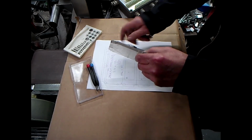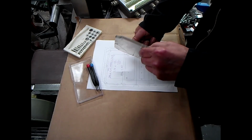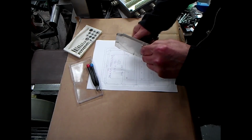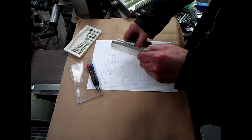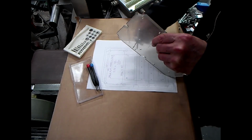Inputs to the 16-bit shift register are once per millisecond. The 2 least significant bits, 1 and 0, of the value to be evaluated are cleared. So if greater than 3, then a 1 goes into the shift register, else a 0 goes into it. If all 16 bits of the shift register are 0, a double pole relay is turned on.